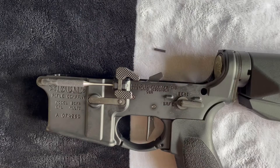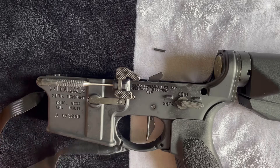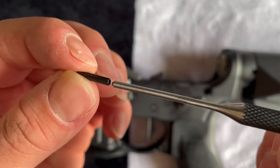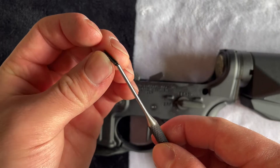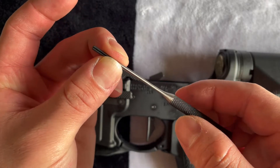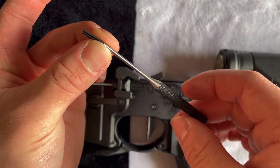I'm going to look for another punch to use. I need something like this — a different size punch. The punches come with a little round ball at the tip; you can use that as a starter guide and put that round ball in the hole and punch it like that. What I've seen some people do is take a piece of electrical tape to wrap these two together so the pin doesn't fall. I might do that actually, because that'll help get me started.